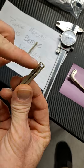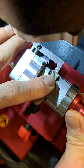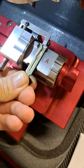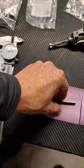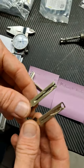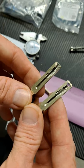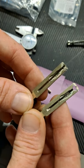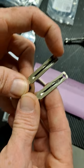Take the 80,000 key that has a hole in it — same thing: put it in the jaw, tip stop up to the tip stop, clamp it in, and make sure it's clamped in there pretty good so it won't come out when cutting. These are two different thin blade 80,000 series keys — the one with a hole and the one without. The entry and exit cuts on both these keys will vary depending on where those entry cuts and exit cuts come in and go out.